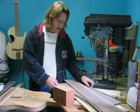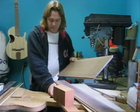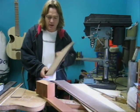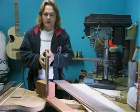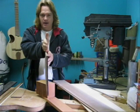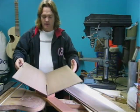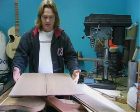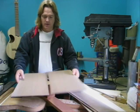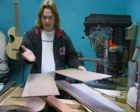The body of this guitar is going to be walnut. I have a piece of what they call bookmatched walnut for the back. It's a piece of walnut that was like this and has been taken with a bandsaw and sliced right through, so it opens up and the grain on the two halves becomes a mirror image of each other. This is quarter-sawn walnut, so the grain runs straight up and down — not on an angle — which makes it stronger.